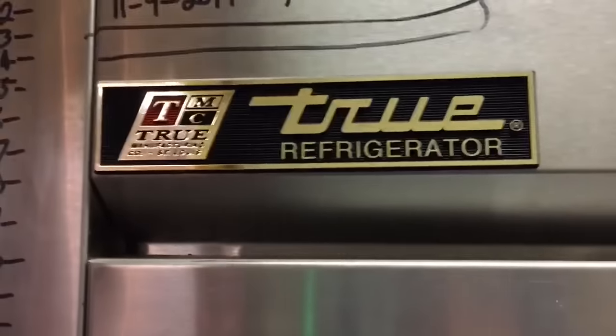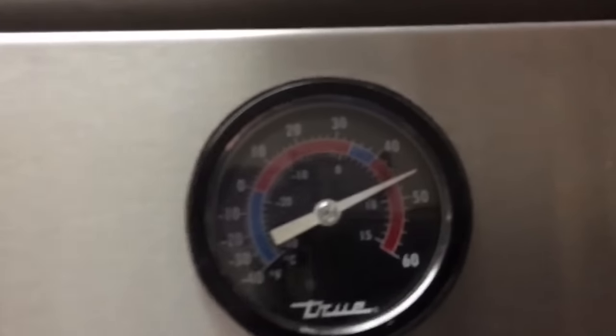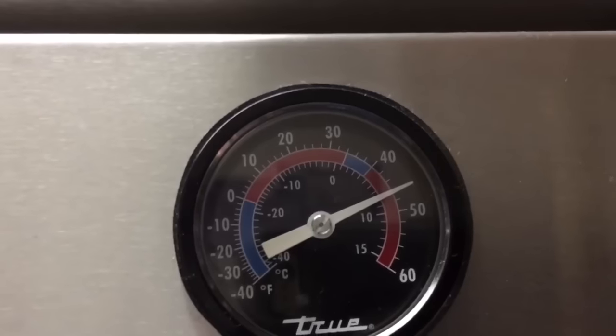Thanks. Okay, you guys, got this door gasket in. It went in pretty nice, really nice with the oil. A little mineral oil on the gasket, put it in the groove, and hit it with the palm of your hand and just beat the heck out of it. It works good. All right, cool. I'm done. And she's back to temp. She's coming down.